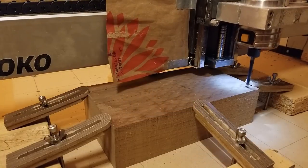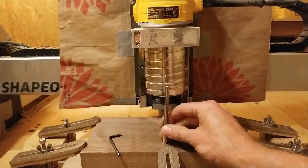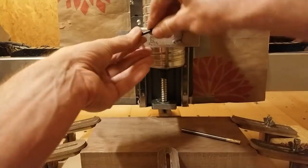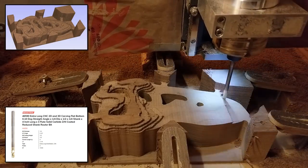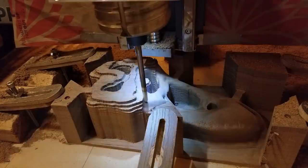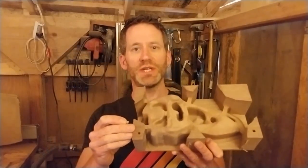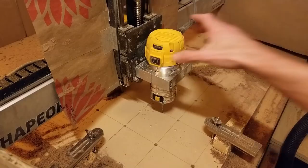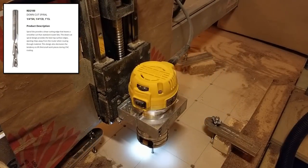I first drilled the dowel holes with the standard 3-inch long bit. Even with the Z gantry at maximum height, the extra-long bits won't fit between the router and the stock surface, so I had to move the router to a higher position in the Z gantry clamp. I could then run the stock clearance pass with the extra-long 4-inch end mill, followed by the roughing pass of the outside of the right side skull using the same bit. I swapped the end mill for an extra-long ballnose bit to do the finishing pass. I cut a quarter-inch dowel in half and made the dowel holes in the stock deep enough that about 4mm sticks out. I used a down-cut bit for the dowel holes in the spoilboard, as an up-cut bit would create ruffled edges preventing the stock from sitting flush.